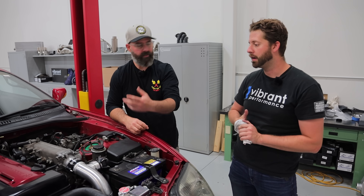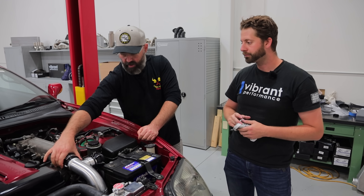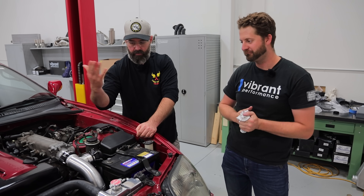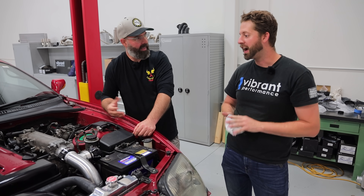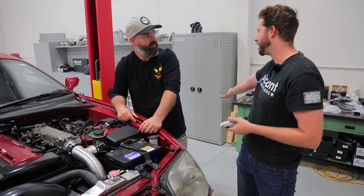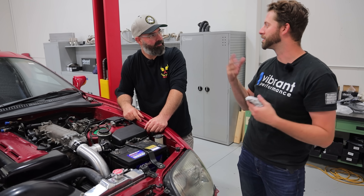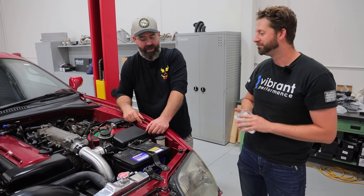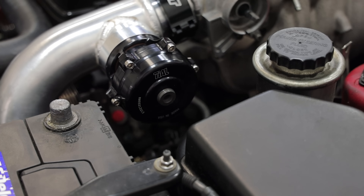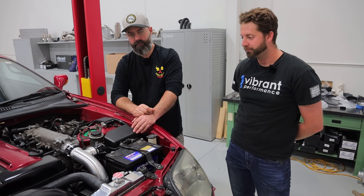So that motor will rock quite a bit under load. And it's obviously a very strong clamp as well — you haven't seen the diesel guys blow these up making 200 pounds of boost. I've seen billet blocks split and flip, and the HD clamp and tubing is what keeps the motor from leaving the building. Wild. We also fit up our Tial blow-off valve here, which clears the battery nicely. It's in a subtle location, kind of tucked in the same plane as the top of the engine. And we got rid of that traction control system — we forgot to mention. The throttle plate fit up perfectly there.